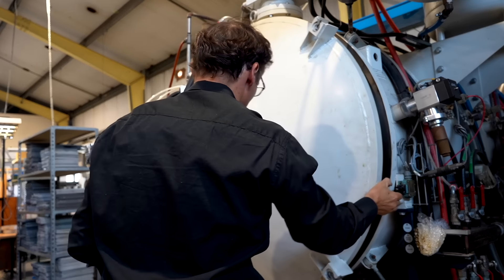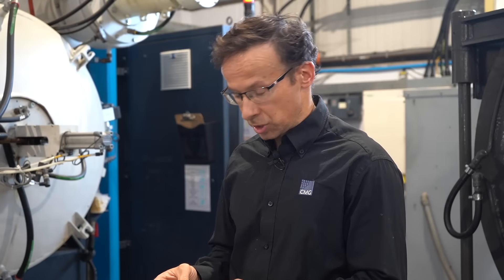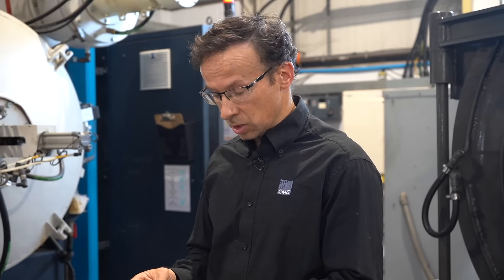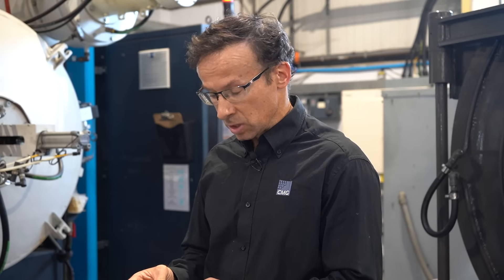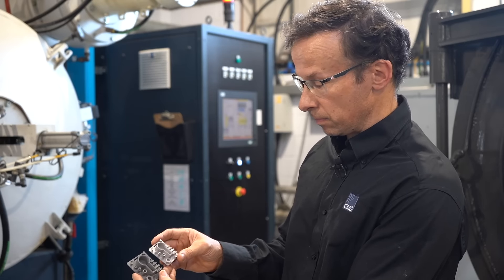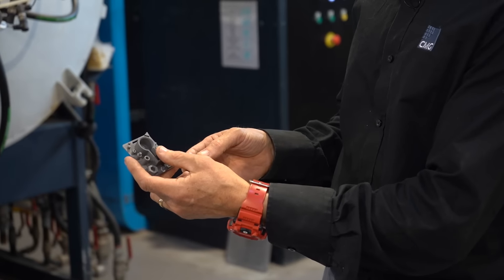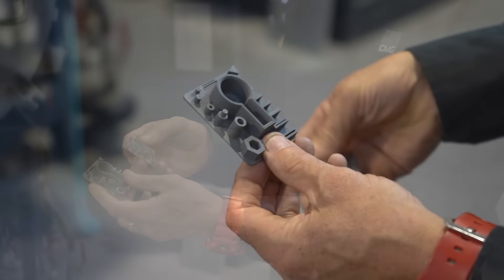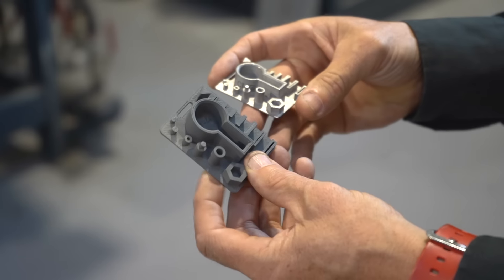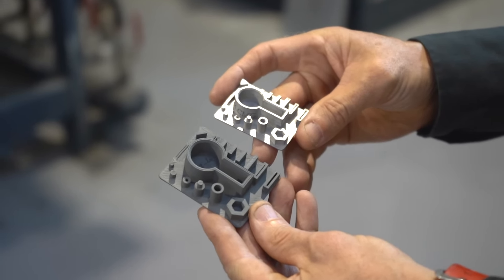So if the part was 10mm thick, it may have to stay in the oven up to 10 hours with acid being drip-fed into the oven. One thing we've got to mention is the shrinkage. This component was designed with 20% shrinkage in the X and Y, and 26% in the Z. As you can see holding them up, there's quite a lot of difference. During debind it holds its same size and shape — that's very important at the catalytic debinding stage.